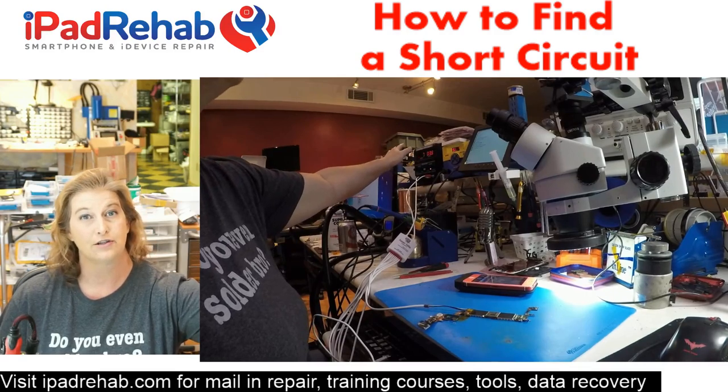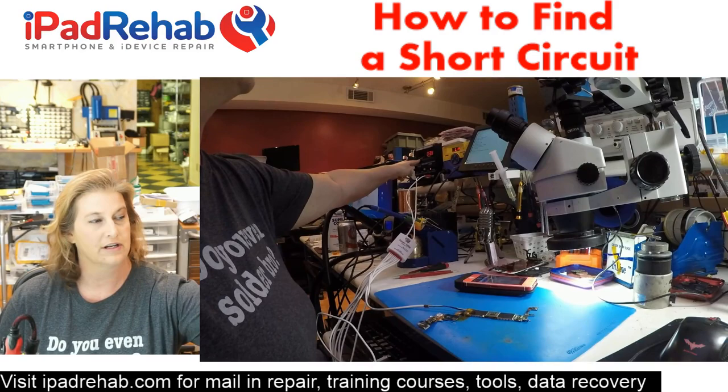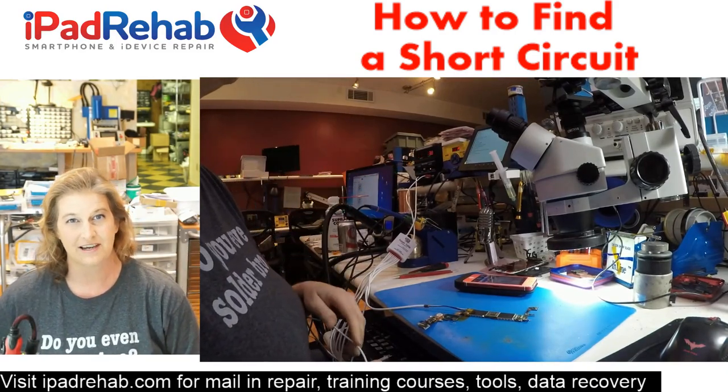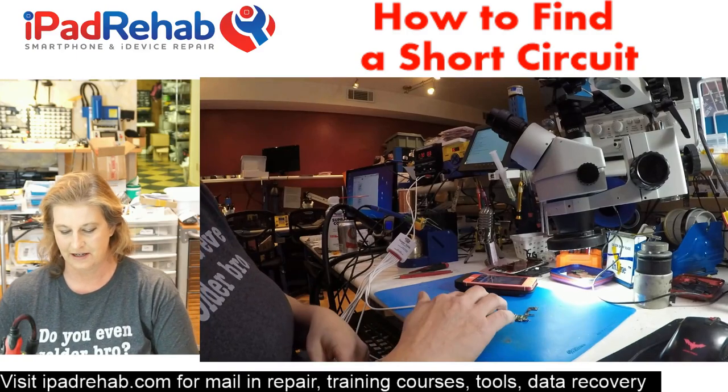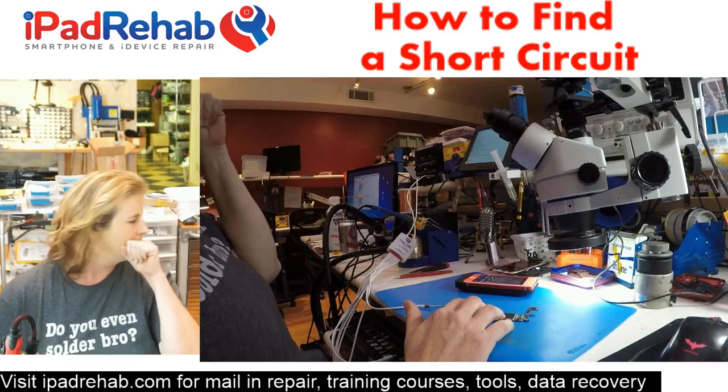That is far too high. That's not a normal boot signature. That's not normal current consumption. Going from 0 to 0.7 and hanging out at 0.7 means that something is up. This board has a short circuit. All right, so let's turn that back off.